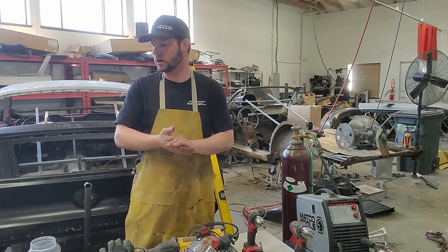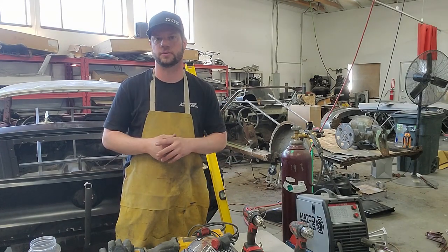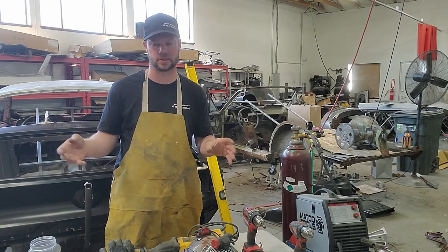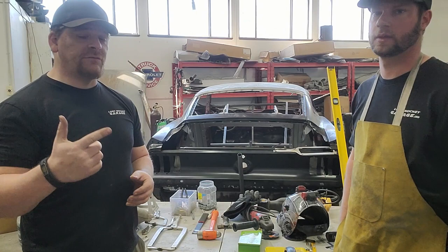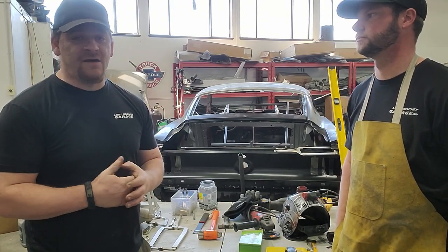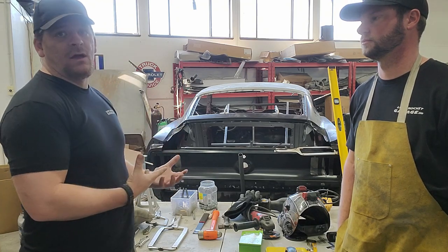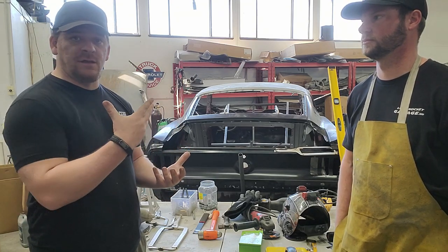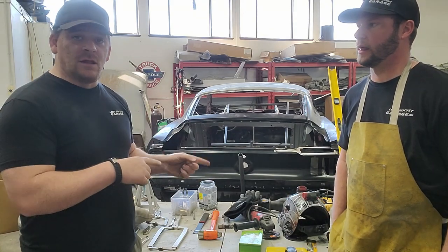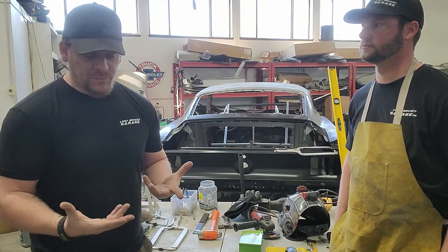So, now we're going to go into optional equipment that may or may not help your conversion process, because sometimes it actually is a combination of these things that makes it go faster. I want to give you a couple of tools that, if you have the money, have been pretty helpful for us. Now, most of the welds on the Fastback conversions are going to be plug welds. That's basically what we do. There are a lot of panels that you actually can spot weld, though.